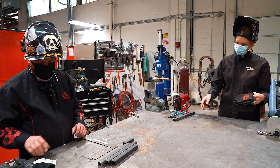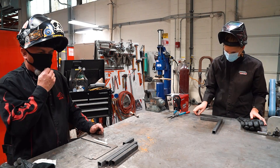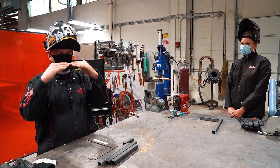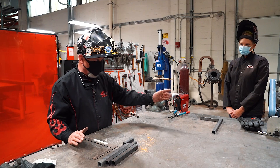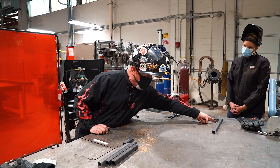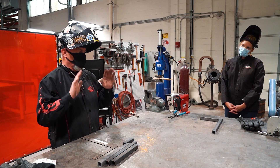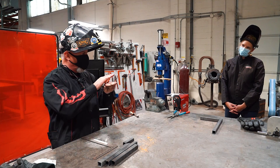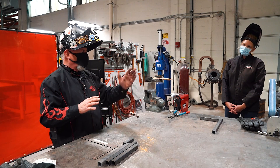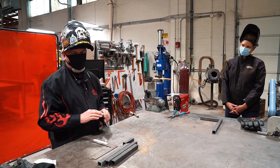We're going to set up a square joint. I'd like you to set those up at right angles down the end. We're going to run a butt joint — that's when you've got two pieces of metal stuck together on the same plane. And the good thing about tubing is we're going to run a T joint down that surface. You have a choice to run your T joint vertical or turn the part and run it horizontal. We always choose horizontal if given the opportunity — that way it's easier. For a beginner, much better to stand the part up and run the joint horizontally.